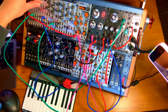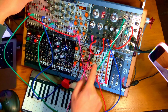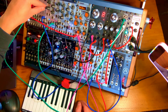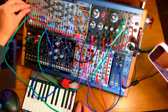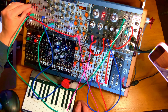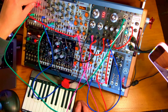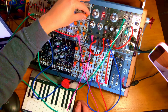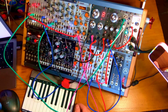You can actually use like an arcade button or something to manually advance. I can use my contour 1 actually, if I want to, just repatch everything. So that's another cool thing about having that tuner on board, is you can actually use it to tune the CV coming out of your sequencer to match, you know, actual notes in the 12 tone per octave system. Right, now I can bring it up, and it's not going to sound so random anymore. It sounds like a quantized sequence, see?